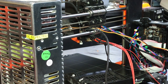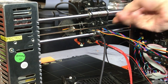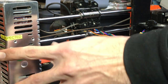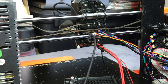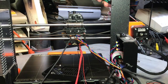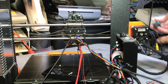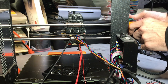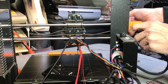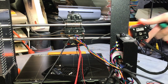The MK3 and MK3S are basically the same from this point on. All we need to do is free the belt. It's not very tensioned, so that's easy. To loosen the motor in case it's too tight: there's a fastener on the top of the X motor — loosen that. In this case the little square nut isn't doing anything, so just remove it. Then loosen the top two screws on the front of the motor enough where you can pivot the motor — not just within the channels but actually pivot past that. There should be enough tension on the bottom screw to kind of keep it in place for reassembly.